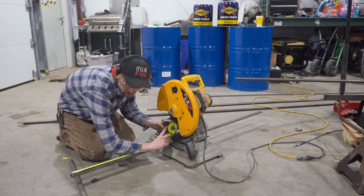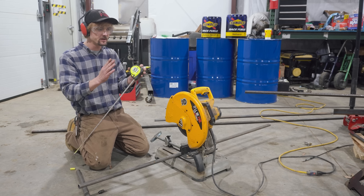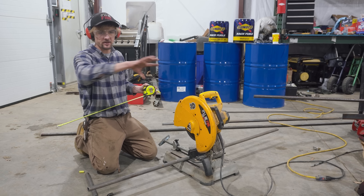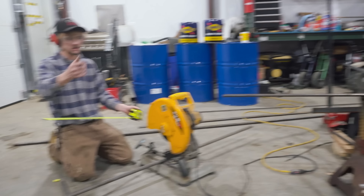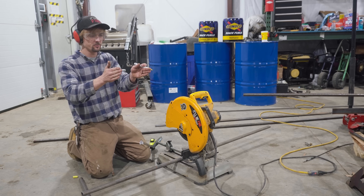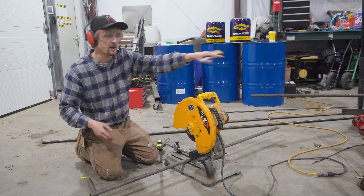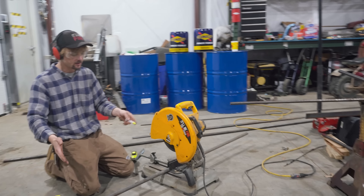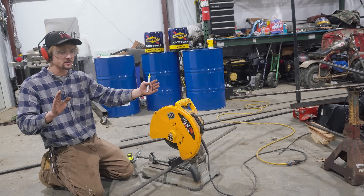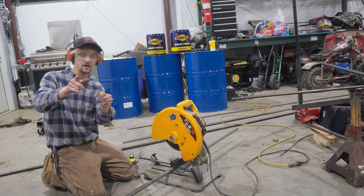Some tube, boys. I'm cutting out three 26-inch pieces. We're going to notch them down on either side to 25 inches. They're going to go right behind the seat, in front of the seat, and mimic the dash. Then I think at one or two of them we're basically bending at the middle one, going straight, but the wedge is still going to continue up. And then at the motor we're going to drop it down at the back half. Either way, this is going to allow us to set the size and width of the top and bottom bars — we tack them in place and bend it — of the passenger compartment.